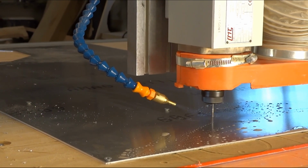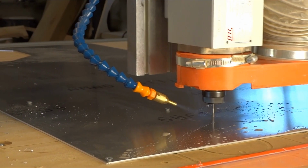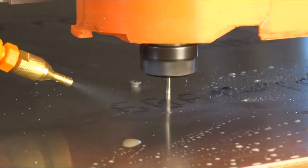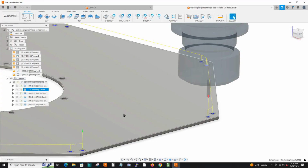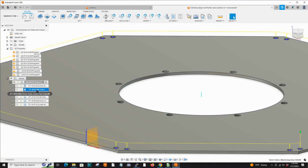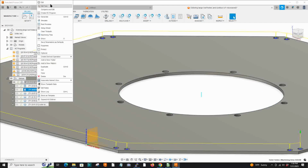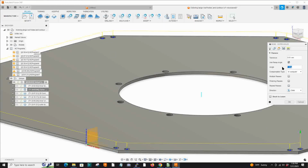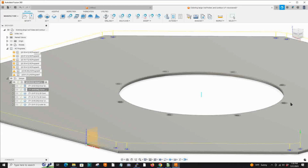If you go too fast, I end up with oval holes. So if I do the 330 millimeters per minute, I get round holes. I like round holes. All right, this is the next set of holes. It's a 3-minute run. I'll show you the details here. Again, same setup, 1200 revolutions per minute, 1000, and then 330 with a 1 degree. That 1 degree is the most important part of the video.